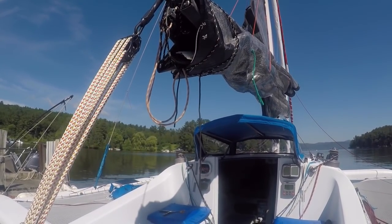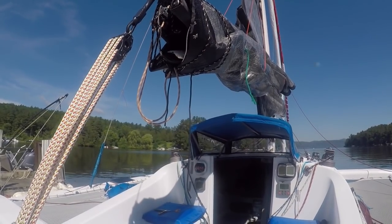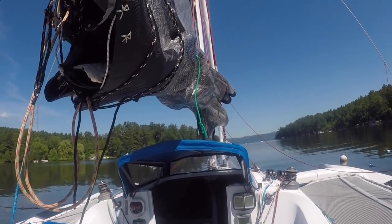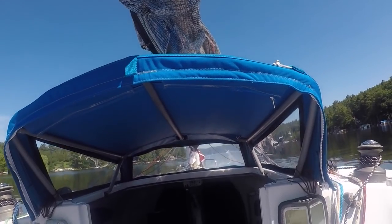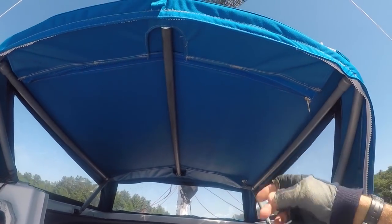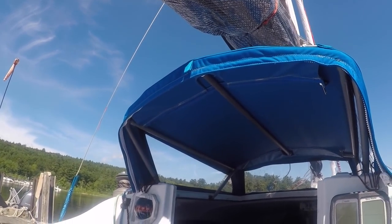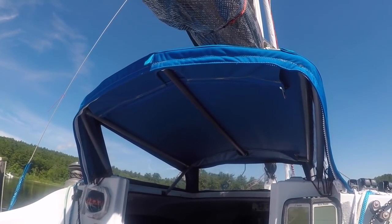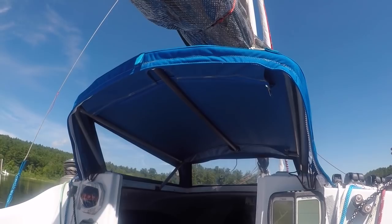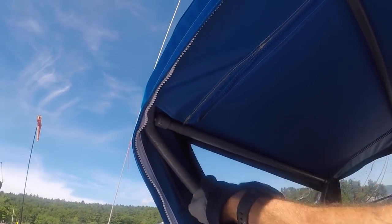I've just had poles on the side in my previous incarnations on my previous boat. The pole pushes the forward arch forward and back arch aft, and it just stands there. On this one I've actually lashed it too. I did just add this middle pole. I needed a hard point because I'm mounting a solar panel on top of this. The poles themselves — how I did it is I fill them with sand, these are PVC poles, fill them with sand and bend them with a heat gun around a frame. So you get a piece of plywood, put nails in, and when you make them, make a few because you never know if you'll need spares. Then I take a carbon fiber sleeve and epoxy that in over them, and they are just rock solid — it's essentially a solid dodger.